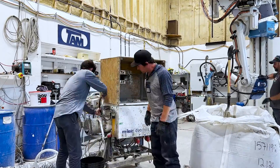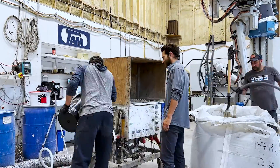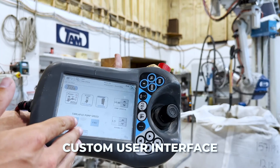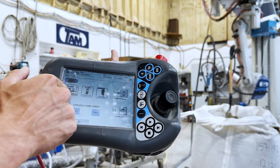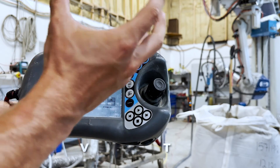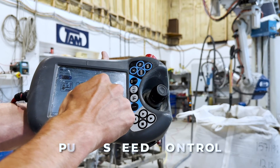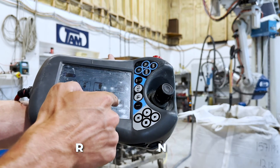The mixer might not look like fun, but it's actually the most important part of the job. You've got to make sure all the water and materials are flowing properly, not to mention a thorough cleaning. This is a custom user interface they set up with the ABB robotic arm to control the additions they made, including pendant control of the pump, the ability to move the pump forward, the valve which can shut off or turn on the flow, allowing a start-stop function on the printer. They have a variable flow drive to control pump speed in Hertz and roving control.